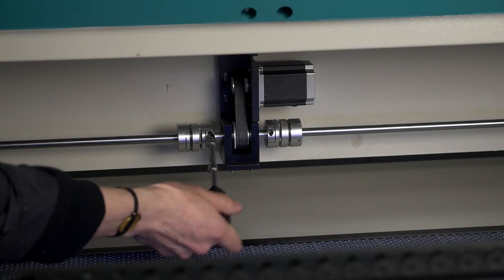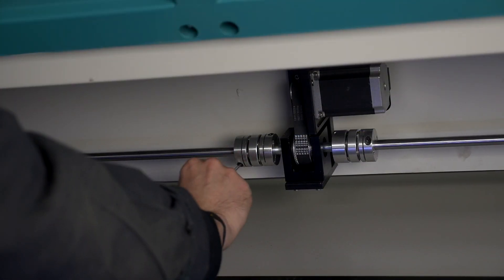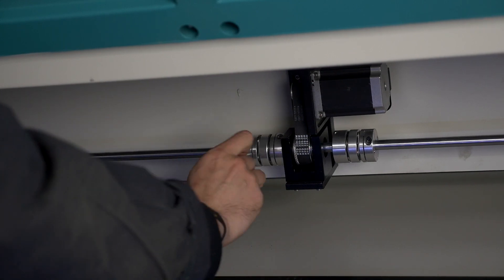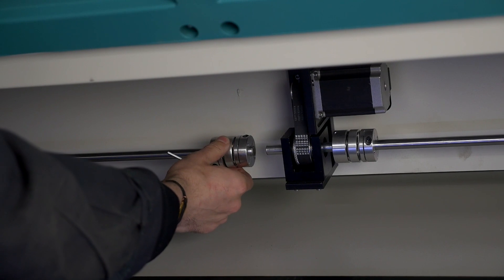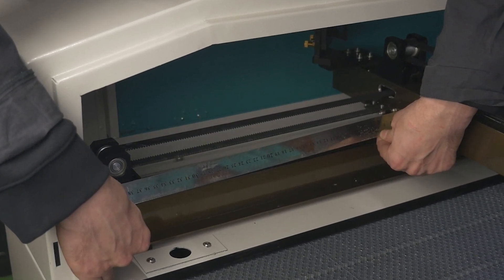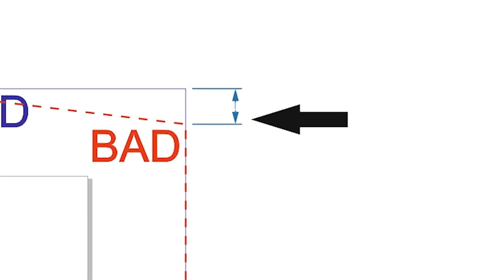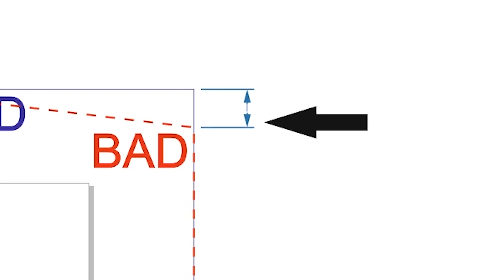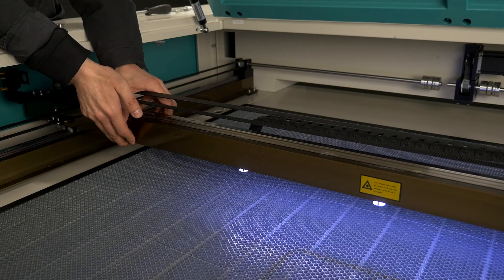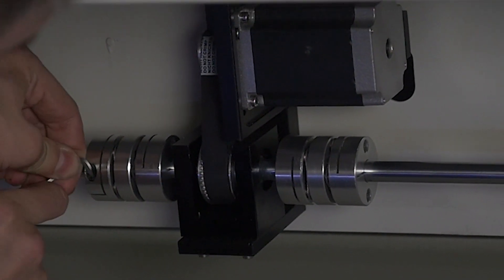Find the motor that drives the Y axis — it is on the far side of the work table in the middle. Loosen the coupling on the side of the gantry you want to adjust. Now, one side of the gantry moves independently of the other, allowing it to be adjusted. Position this side of the gantry at the distance from the stationary mechanical element according to your measurements in the graphical editor. The other side of the gantry should remain in its original position. Tighten the coupling.